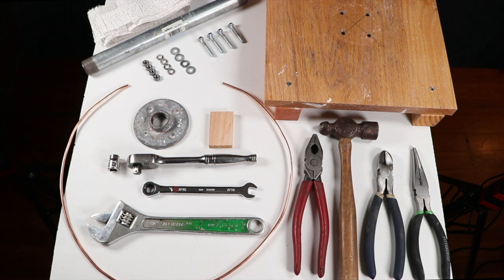We have a solid 12 by 12 maple quarter inch thick board, and you can see that there are four holes in the center where you just get a straight edge and you X out and you make sure that the holes are correct when we get to the flange over here. But you can also see that there is a 1 inch by 1 inch or 1.5 inch by 1.5 inch, depending on how you want your footing at the bottom to elevate that board so your bolts can bolt on nicely. You don't have anything sticking onto the table, but also when you pick up a mold, which can be very heavy, when you have all the plaster and clay and all the layering of detail coats or whatever it is your process that you're going to be doing, you want to be able to grab onto it from the bottom. So make sure you do have a footing.